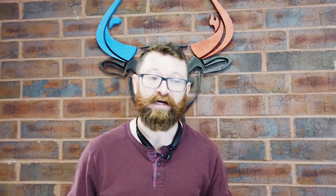If you get unlucky enough to have a cap nail right there, you have a whole other issue. Damaging the underlayment is still not a pre-damage condition — it doesn't meet the policy requirement to bring you back to pre-loss. We can't leave nail holes behind in the felt. It's not allowed. A nail hole is damage.